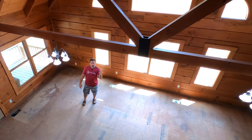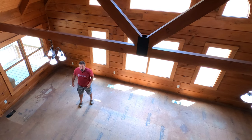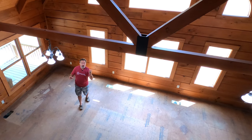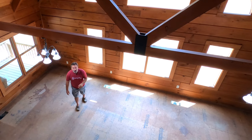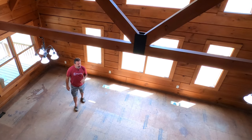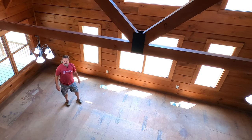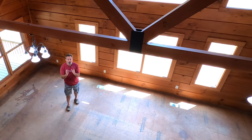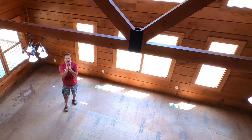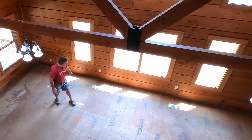Now we also have a hallway running just under you that goes this way through the room. You want to run your boards down the hallway. You don't want the little shortcuts, right? So knowing all of these rules, we also have to take into account our floor registers. In some of our back rooms, the floor registers are really close to the walls. So I don't want little pieces, little boards. I want to run them along with the registers.